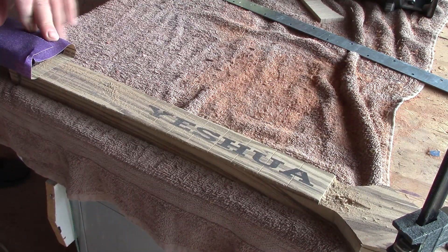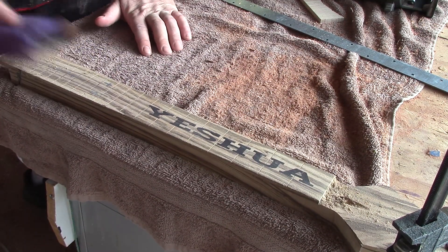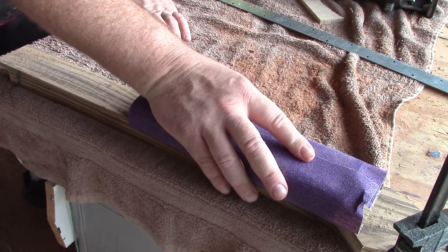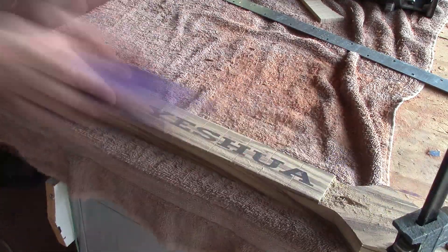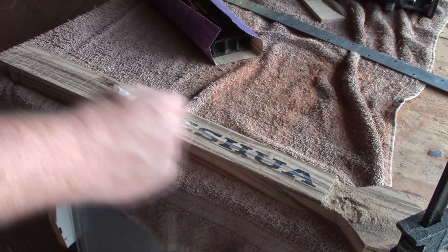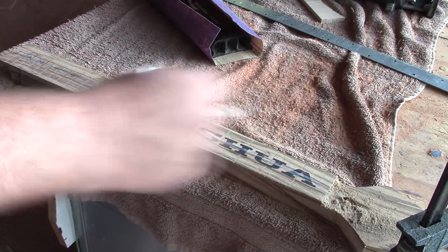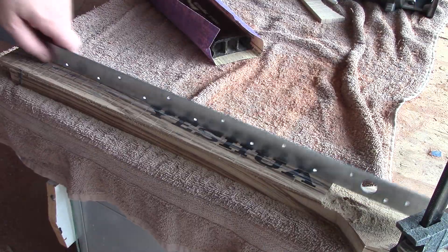I'm gonna stop right there because I want to take the time to tell you: make sure you're not dipping on the ends. When you're coming down here, you're not coming and dipping down. You're not dipping on the top. You kinda wanna stop right when you get to it to make sure that don't happen. The only real surefire way I know to make sure your radius is correct is by drawing some kind of line across the middle there. But I always check it with my straight edge — make sure I'm not screwing nothing up.